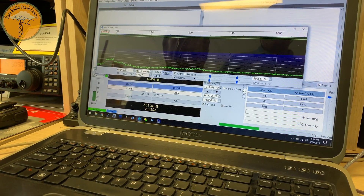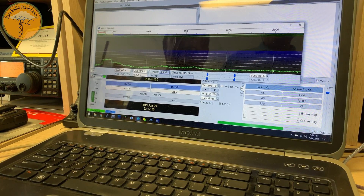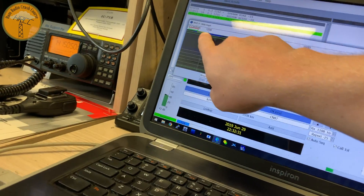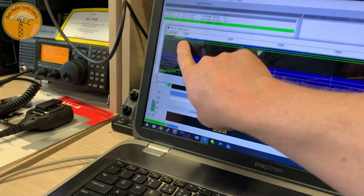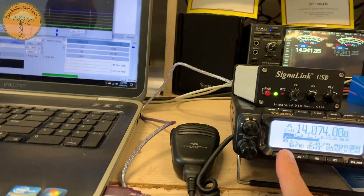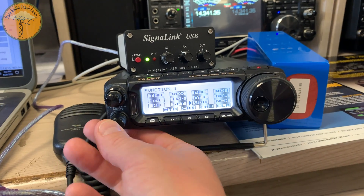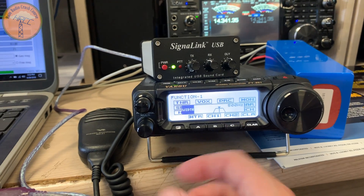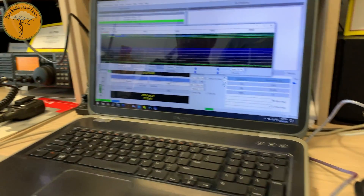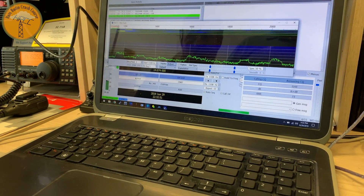So I should be able to bump this up. Yeah, it goes up a little bit at a time. There it goes. Now your problem is all your data is compressed right here. We need to spread this out over the entire band. How do you do that? You go here, width, 500 hertz — no, you've got to open that up. Boom, look at that! And now the waterfall will fill out. At least that's the plan. We shall see.